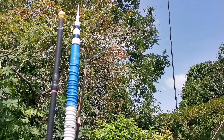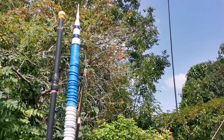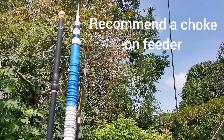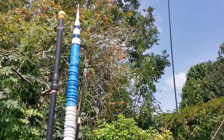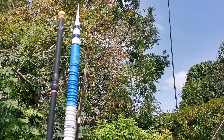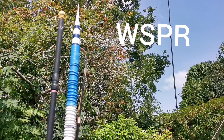So let me show you how to set it up. This antenna can be ground-mounted or on a pole. Addition of a counterpoise is not essential. I've tried adding some at ground level with little or no change to the VSWR or actual performance of the antenna. The coax feed will need a little 1-to-1 choke along its length, or a choke coax cable coiled up to stop RF from running down the outer braid. I've been using the analyser built into my Xiegu G90 to fine-tune the antenna. I wanted to ensure that I'd not just built a vertical dummy load, so I conducted some on-air tests using WSPR, a weak signal propagation reporting tool.